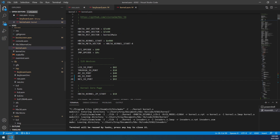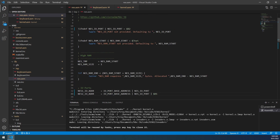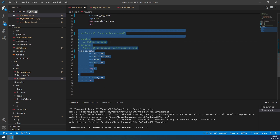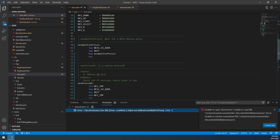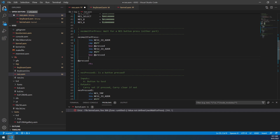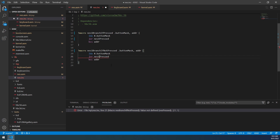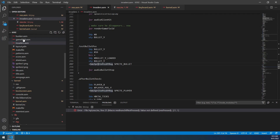So that was a bit of an anticlimax — I forgot to update my software. The ports have changed and the NES button order has been reversed. I'll go update that in my code, burn a new ROM, and see how that looks. I also have to add support for the second NES controller since my code only has one at the moment. I have many helper macros and subroutines to deal with all of these peripherals but I don't have any for NES 2, so I'll add that in as well.